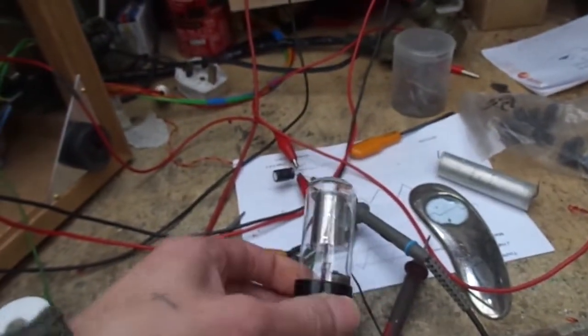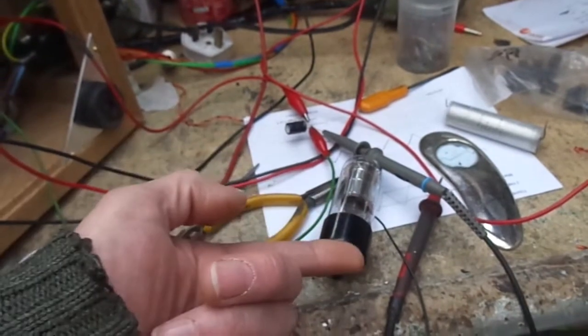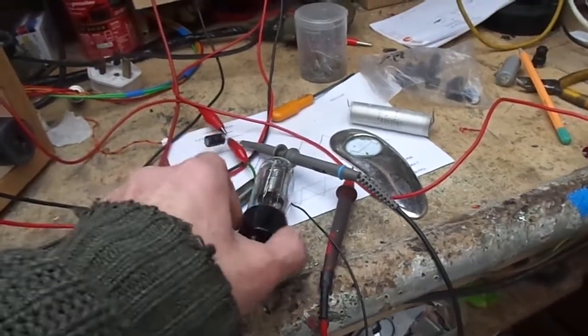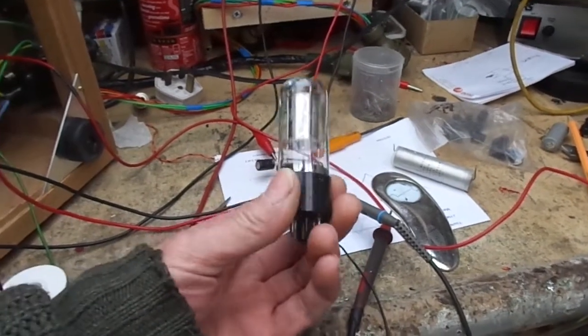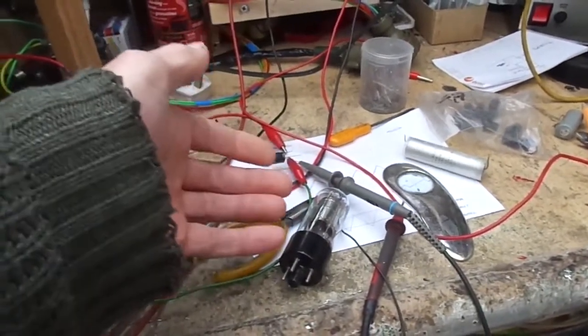So did you understand that? Basically, these voltage reference valves, like that Zener, usually have a capacitor across them. It's only got 2 basic elements, a cathode and an anode. So from anode to cathode, it usually has a capacitor to stop it oscillating, to shunt AC frequencies to ground. What it's saying here is, because of the impedance characteristic of this valve, if you just put a capacitor across it, there's a chance that it can form a tank circuit like you get for oscillators, and it can self-oscillate, parasitic oscillation.